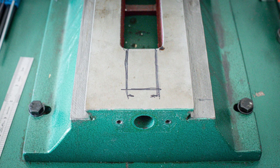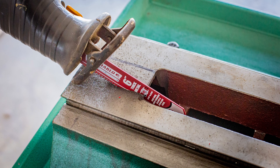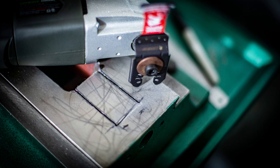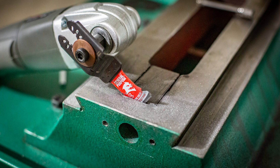The cast iron is only about a quarter inch thick in that area and I used a reciprocating saw with a blade with carbide teeth. A cheaper bi-metal blade probably would have worked for such a small cut but the carbide tip blade cut through it like butter. Once the two longitudinal cuts were made I needed to make a cross cut. For this cut I bought a carbide tip blade for a multi-tool that I had. With such small teeth it cut much slower than the reciprocating saw but it completed the cut in less than five minutes.